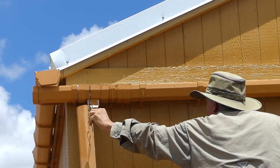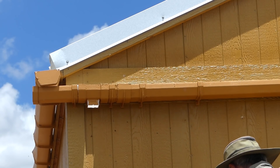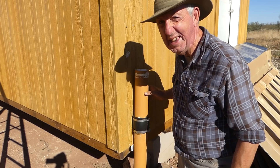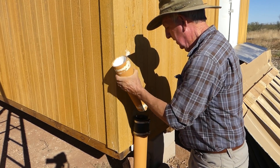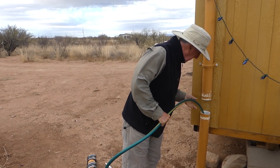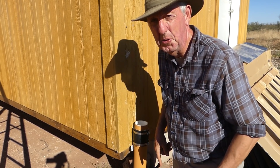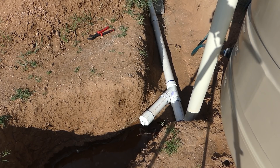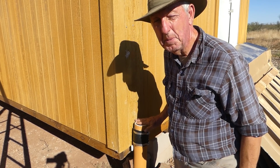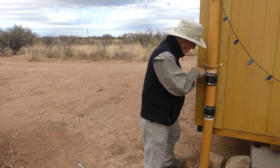What I decided here with this 3-inch schedule 40 downspout was to create a break in it. This piece just comes right out, and the reason is so that I can take a hose and literally put it down in here, turn it on, and flush the whole system out. At the other end is a clean-out, and I can unscrew that so the water will flow all the way 45 feet down the trench and out the clean-out pipe. These rubber sections are 3-inch Fernco joiners — they're even used for sewers and other applications. Once tightened up, they're pretty waterproof and don't allow leaks.